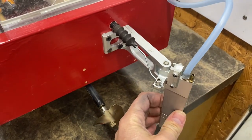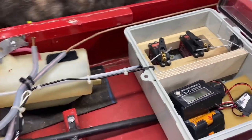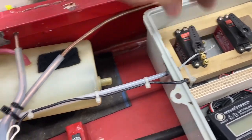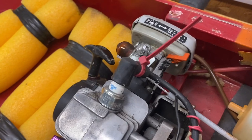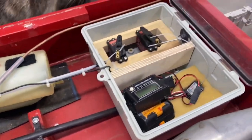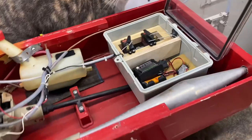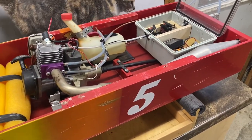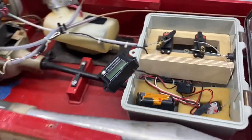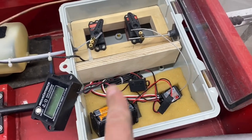The rudder on the back that does the steering is connected with a solid rod. I have a little rubber boot on there to seal it up — I buy those from Zip Kits; check out their website, zipkits.com — they're a sponsor of NASS Boat. Up here on the throttle I use a flexible cable running through a little plastic tube that runs up to the carburetor, and you can see it just pulls it and releases it. Those are the two servos, referred to as channels — on boats it's just two channels, one for rudder and one for throttle. Airplanes might have three, four, or five, and a car sometimes two or three. This is a little tachometer — that's not anything you have to have; I just had that in there for fun testing different propellers. So the basics of the electronics are the transmitter that you hold in your hand, the receiver, the power source, and servos.